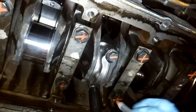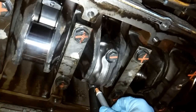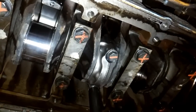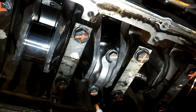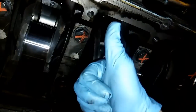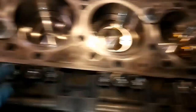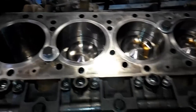That is how you install your rod bearings and your piston packs into the cylinders — not that difficult as you can see. The C-15s are the same thing, except they have four rod bearing bolts opposed to two on these, and they have more cylinder liner seals — actually four. This has been properly torque turned, so go ahead and torque stripe them — that is what you do on all six. Getting back to our deck, we have installed all six. I've put these bolts with big washers on — the reason is while you're rotating the crank to do the others, sometimes it'll push the liners out of their sealing areas, and that's why I do that.